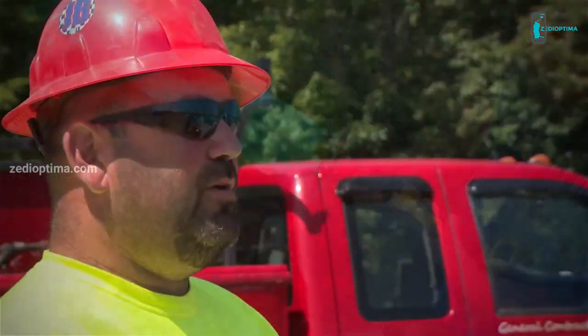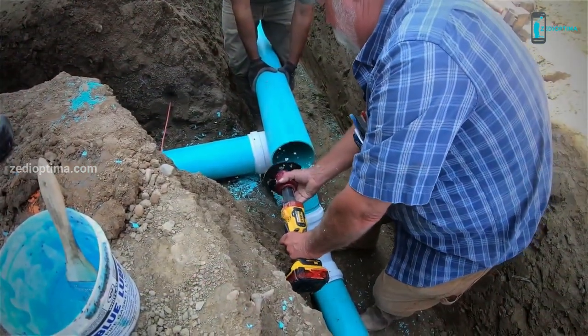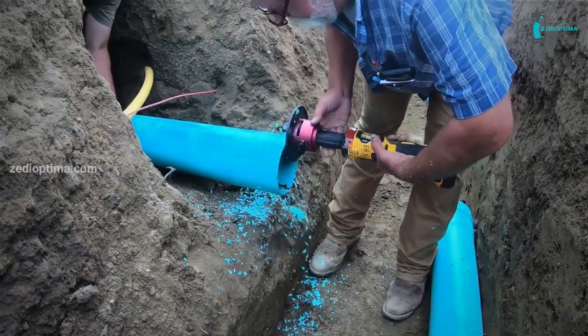The type of pipe we normally use is SDR 35. Anything from 4 to 8 inch, 4, 6, and 8. Majority of it is 4 inch and 6 inch.